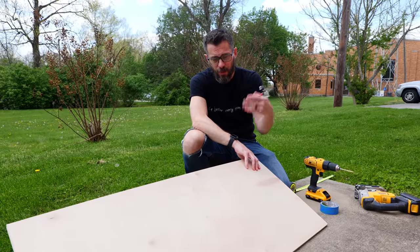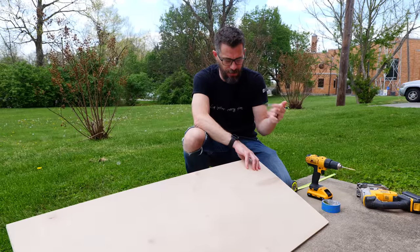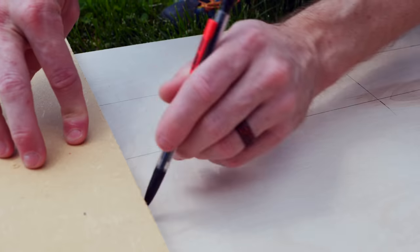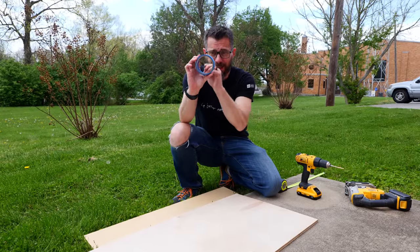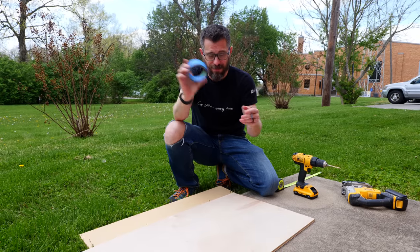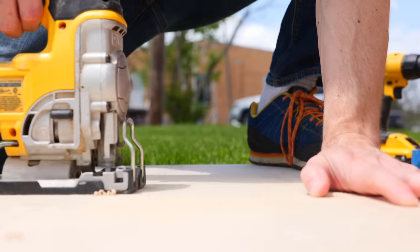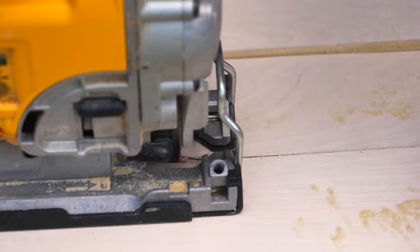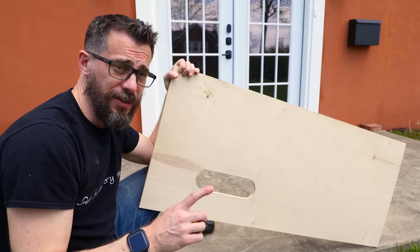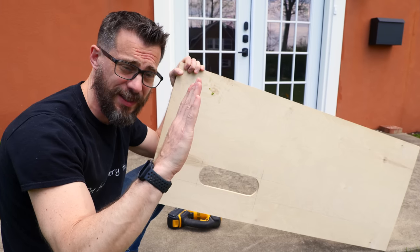Now because we have a big CNC, there's no sense wasting time doing all this by hand, but I want to show you that it's possible and it's not very hard. The only tools you need are a jigsaw and a drill. What I did here on this scrap of material is draw out a straight line and a couple more lines to make a rectangle. On the ends of that rectangle, I use the inside diameter of this roll of tape — it's the exact same size as the pill shape we're using on the CNC. We lay it down, trace it, and cut it out. Having good sandpaper or a sanding sponge to smooth the inside is handy, and if you're using thicker material, go slower — otherwise the blade will deflect and you won't have a flat cut.